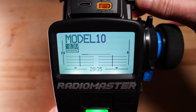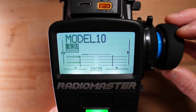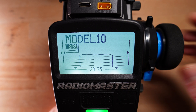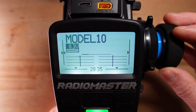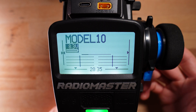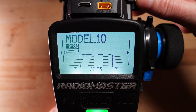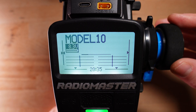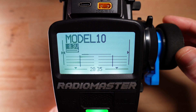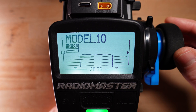If I bring SA to the middle position, then POT S1 has no function and the steering wheel controls both channels — this is four wheel steering mode. And if I bring the SA switch to the inward position, then again the POT has no function and the steering wheel controls both channels, but this time in the opposite direction — so crab mode, if you like.